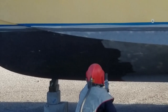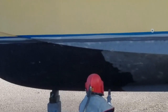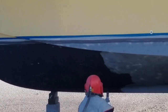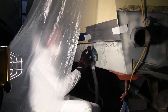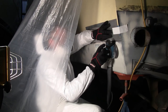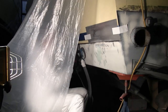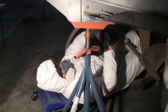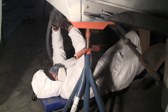From that point, we just set the boat in the building and left it alone for about five or six weeks, and really let all that dry out. This was the initial part of the process — blasting most of the old paint off the bottom. From that point, we just started sanding. I went over the whole bottom of the boat with an 80 grit, just getting off the bottom paint that was left, smoothing out some imperfections, and getting it down to a surface where we could see what we actually had to work with and finding the areas that needed repair. Still sanding — 100% of the area below the waterline got its initial sanding.